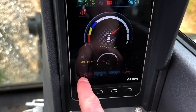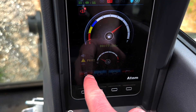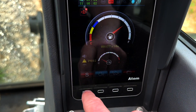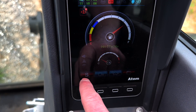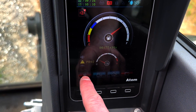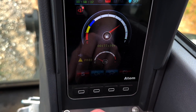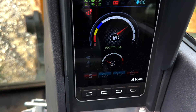This does have an effect — I'm going to fire up the machine, the audio won't be as great, but I'll explain it quickly. This is your standard mode, and then there's breaker mode. Some machines have additional modes, but breaker mode seems to run the machine around the 80% RPM range. It will not idle up or down even if you have it enabled, and the idle control has no effect. I'm going to start the machine up in standard mode so you can see the differences.